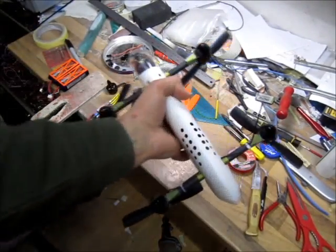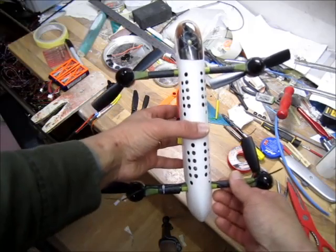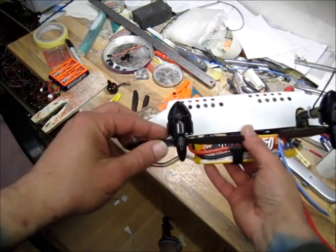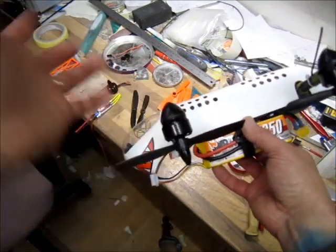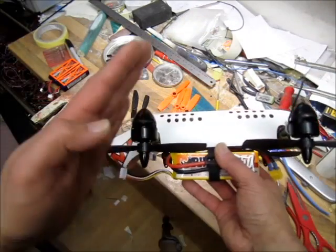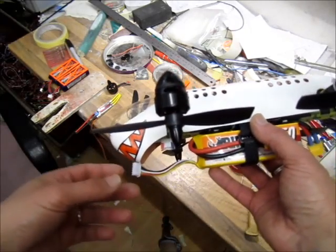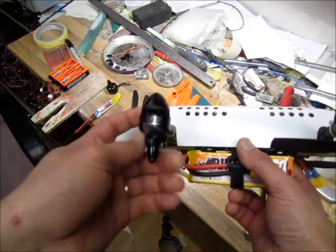As aerodynamics comes into play, I decided to go the slim route instead of a tilting motor route, basically because there's no way of telling at full speed how much tilt there will be. If you miss that tilt it's not going to be efficient. And if there's a tilt of say 45 degrees, the rear props will get the dirty prop wash, which is not going to be efficient.